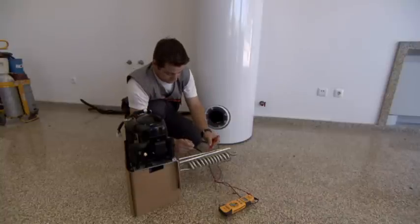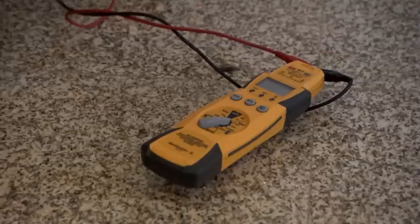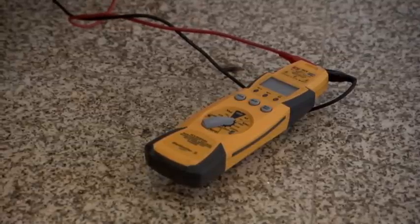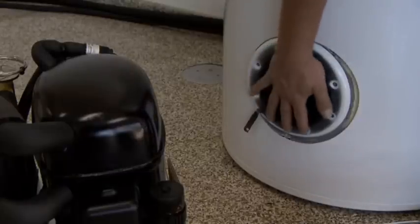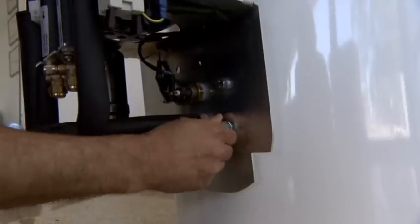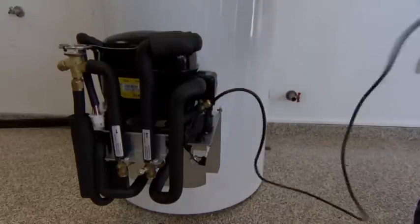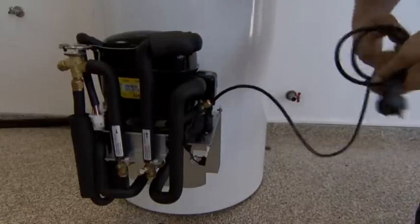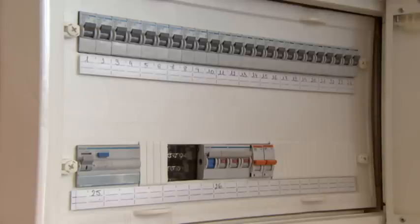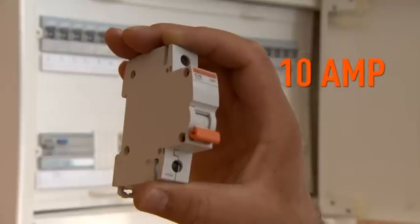The connections to the panel are achieved by tightening the pipes to the connections thereof. Before inserting the condenser inside the tank, ensure that the edgings are not in contact with the condenser, checking whether there is continuity between the two surfaces. Apply the seal joint to ensure it is completely sealed inside the flange. Using the eight screws provided, tighten the block to the water heater's flange in a cross pattern. The electric supply should be 230V 50Hz single phase, carried out by a cable provided with the equipment.